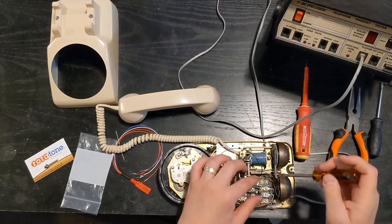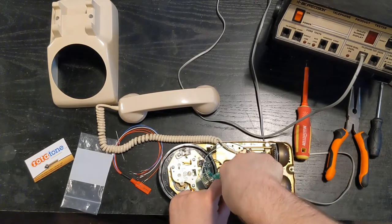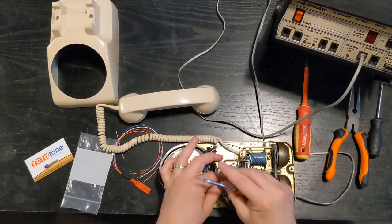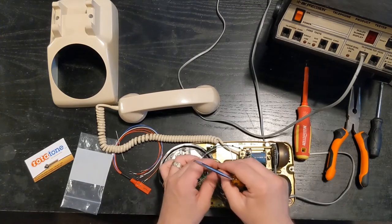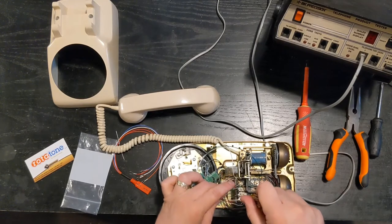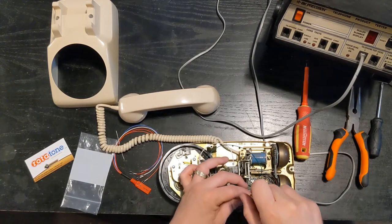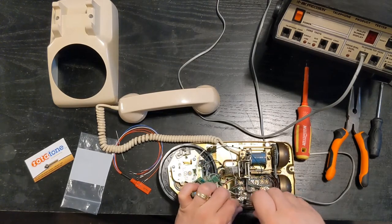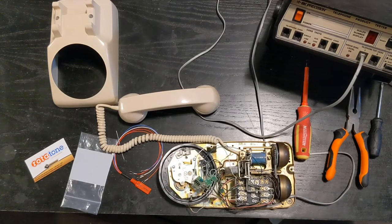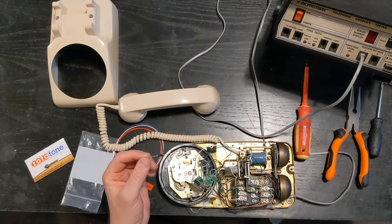We have a white dial wire from GN, which is this guy right here, and the white wire from RR, which is this guy right here. Making sure that if there are any other terminals connected, we leave them in place. Now we're going to take this diode — this guy here — and connect that between F and RR.